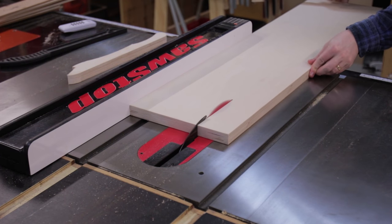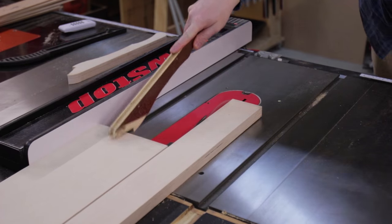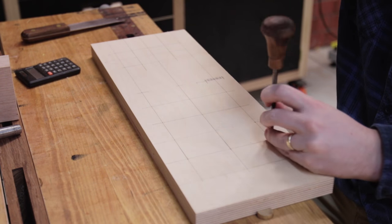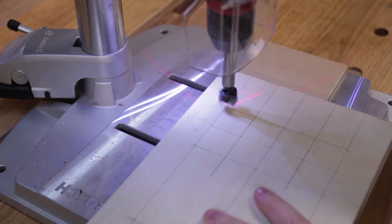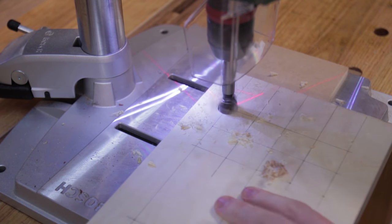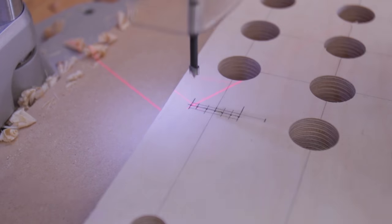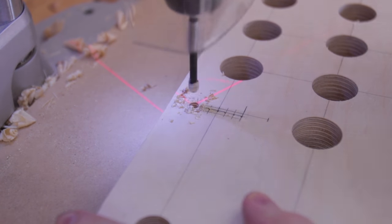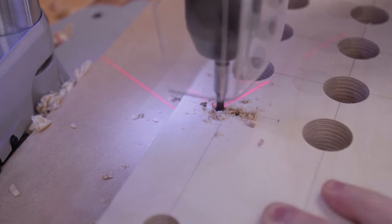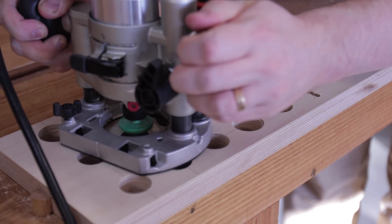The scrap of plywood I had was divided into the tool tray section and a lower stretcher. Using an awl and my mallet, I marked out the locations to drill. For the chisels, there are two different size holes for the different diameter handles, then there are smaller holes for the Morse taper accessories. For my thin parting tool, multiple small holes were drilled and filed out. With a plunge router, I chamfered each of the holes — this makes it nicer to touch, nicer to look at, and helps guide the chisel handles in.